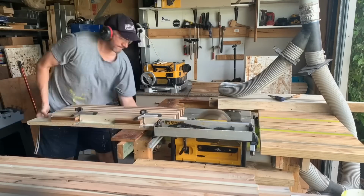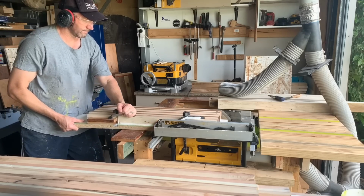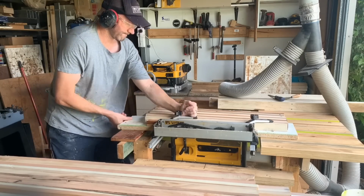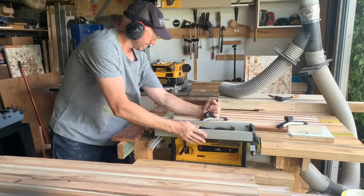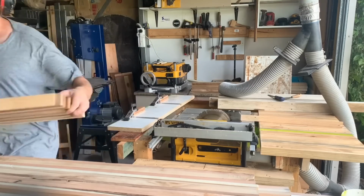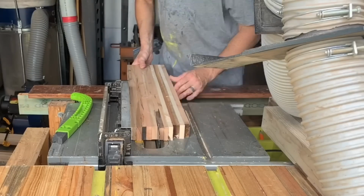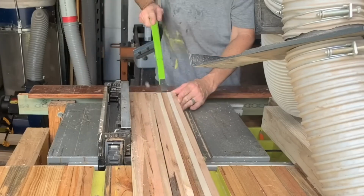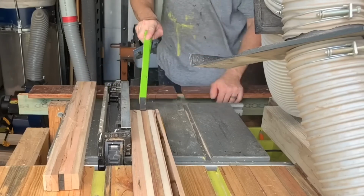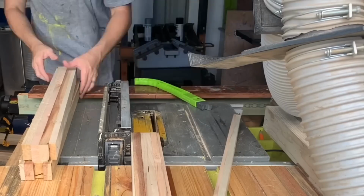So all these slabs, they go back onto my straightening jig, and again, this is why I went with this particular design. I'm actually going to build the other type with the little toggle clamps in the near future just for the slats, but this one is perfect for giving these slabs their first straight edge, so then I can start running them through the table saw to all the same width, just like this, and that's basically going to give me my bricks. So bricks made out of long pallet wood. And then I'm going to do the bricklaying technique to make up this slab.